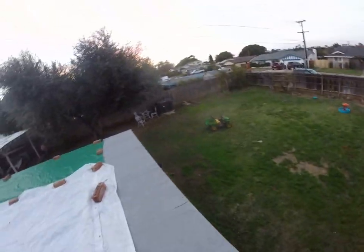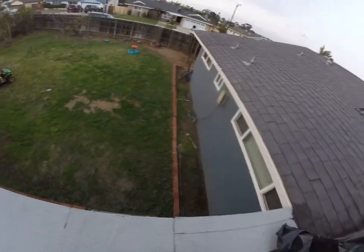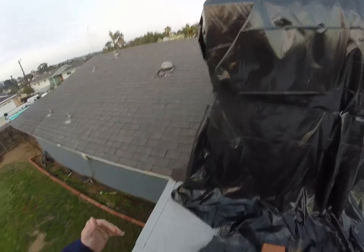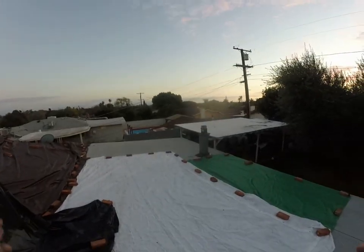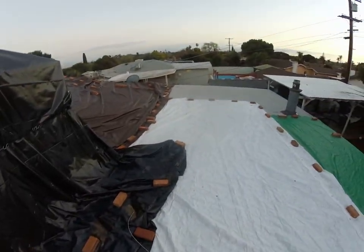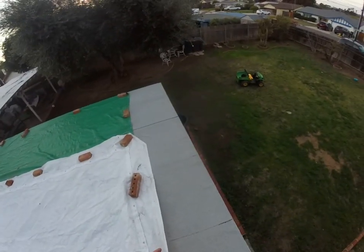So I probably want to suggest that we just leave this roof the way it is. We'll put down one new course of torch down where these roofing products come together, but this is a big addition, and so it'll save us a lot of money if we do this later and just focus on the asphalt shingle. Obviously we could do it at the same time, and the product itself is still in very good condition.